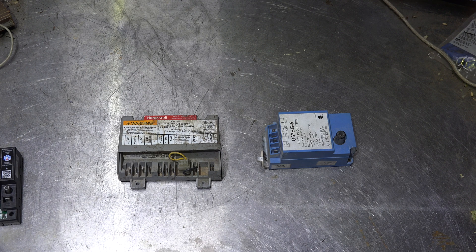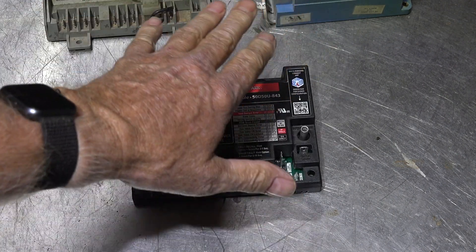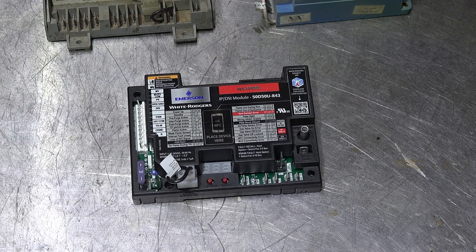These things were different in the way they were set up — some would spark for 90 seconds and shut off and not come back on; some would come back on. There were various ways of setting these up, but when you bought a control it was set a certain way. Some had little tabs to change parameters, but mostly you just had to replace the control. That's why White Rogers came up with this control — it replaces all the rest with one that does direct spark, intermittent pilot, continuous retry, and configurable trial for ignition timing.